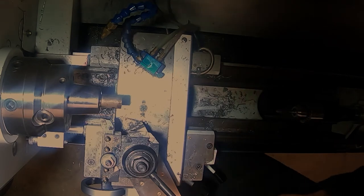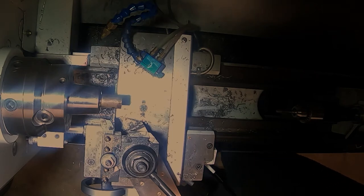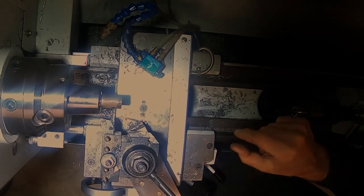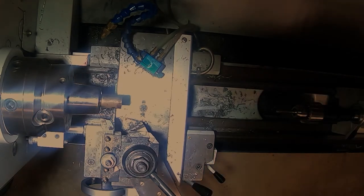I'm using a fairly large tap drill, getting 60% thread. I don't need the full 75% thread on this one. The 60% in steel works just fine and it makes it real easy to power tap without having the piece jerk out of my hand. I'm going to run the batch of 10 pieces threaded on this side with the 5/16ths, then flip it around, do the other side threaded 10-32, and then off to the Rapid Turn. Nearing the end.